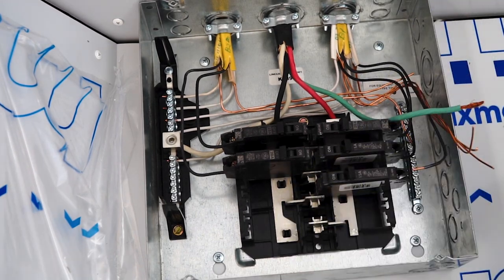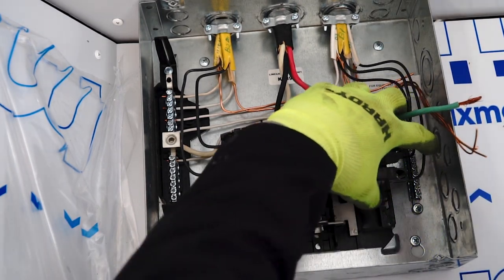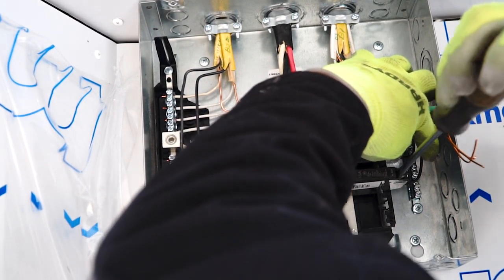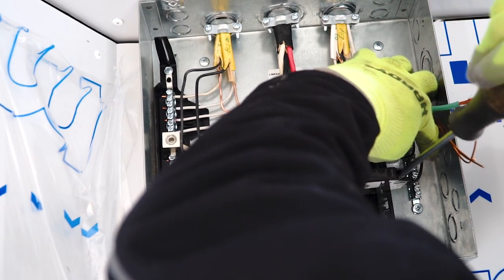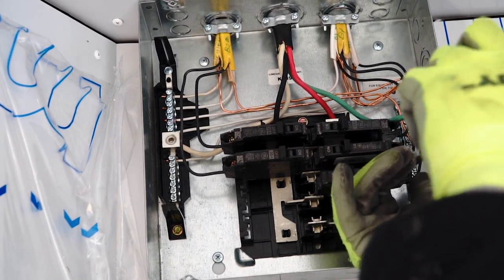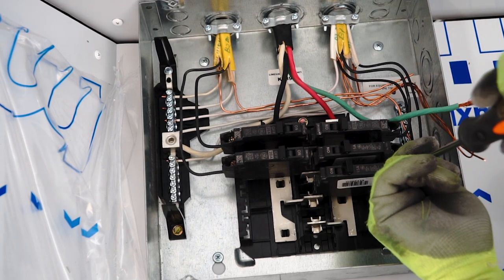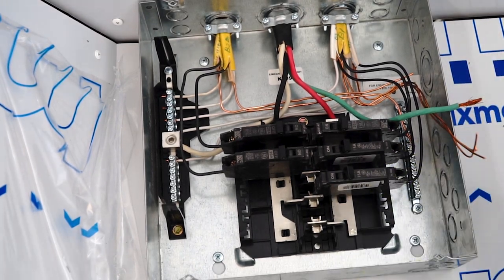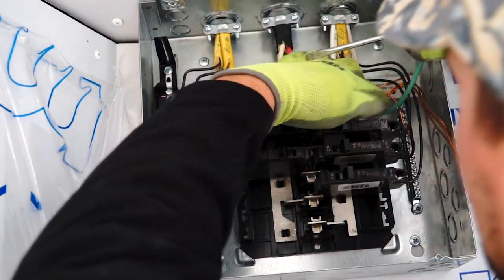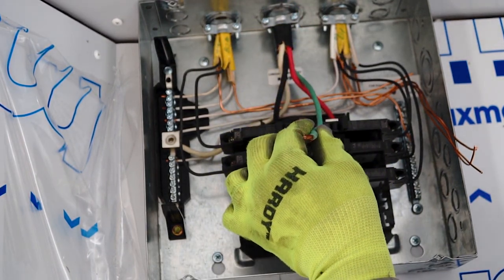As I'm finishing up installing the breakers, here's a close-up of the electrical panel showing how I ran my wires. On the left side I've got all my white neutral wires coming in to the neutral bus bar. All my bare copper ground wires are running over to the right side to the bus bar I installed for grounds. All my black hot wires are coming into the breaker switches - on the left side I've got two 20-amp breaker switches for my outlets on that side of the trailer, and on the right side I've got a 20-amp for the outlets on that side, a 15-amp for my lights, and a 15-amp for my water pump.